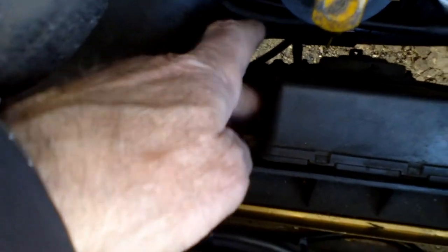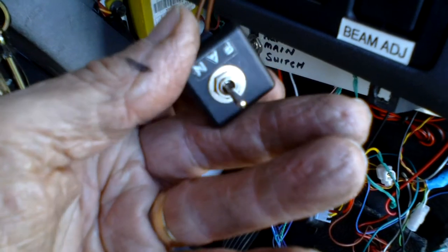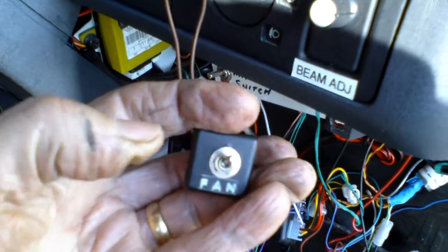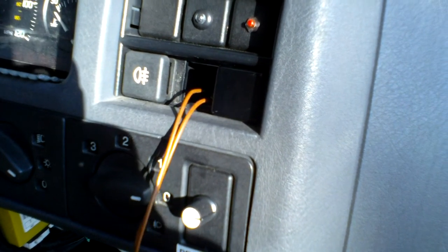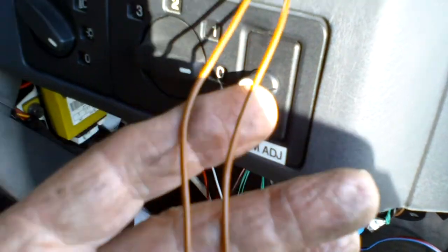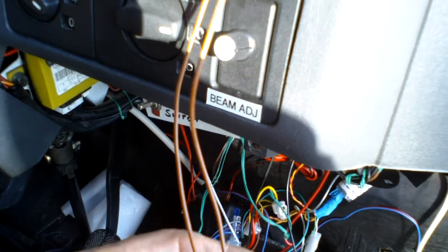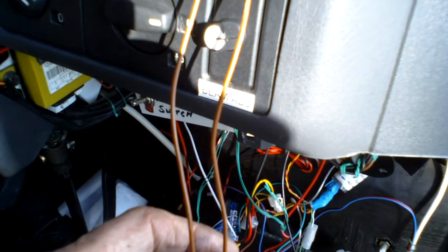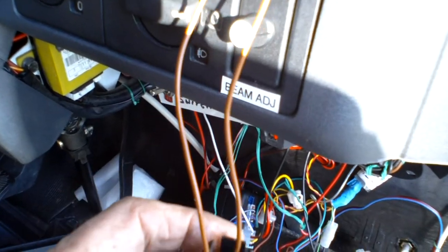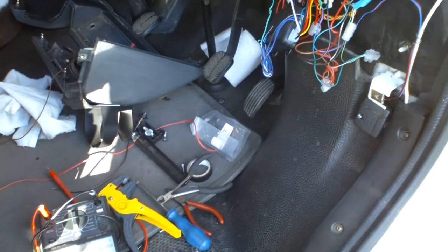There's a blank that I've cut a small hole in and put a switch in - it's only a single pole and it clips back into that position there, making it nice and neat. Nothing interferes with the circuitry as it is at all, because this is only earth - it's taking no current. All the current goes through the fan relay; it doesn't go through the contacts on the fan at all. All I need to do now is push this back and sort all this lot out - it's always the putting it back that takes all the time.